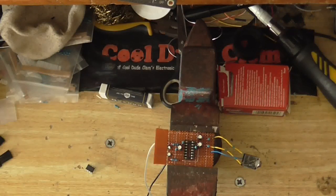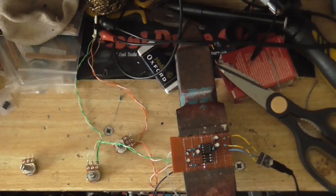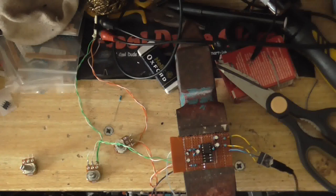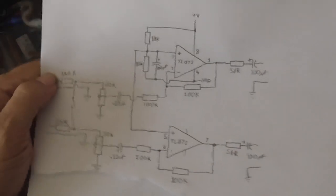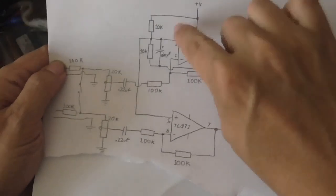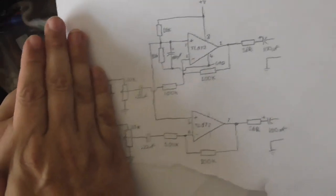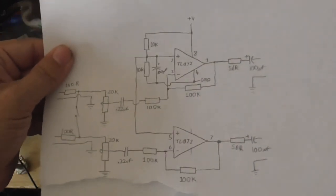I'm going to stick this chip in and let's see if it works. Here it is hooked up to an audio source. I've also added the two volume controls. I really need to use logarithmic potentiometers, but I don't have any, so I've had to settle for linear ones. But it is working. I'll just hold the headphones up to the camera's microphone — there's some silly music here. That's the left, and this is the right. Just using this manky pair of headphones for testing purposes. It's working, and it sounds great. And so this is the final schematic. I haven't drawn in the supply bypass capacitor, but there is a 1000 microfarad capacitor in there, obviously. Ignore this stuff that I'm covering up with my hand — that's not in the circuit. That's a little addition I'm going to make to it later on, so I can switch between stereo and mono.